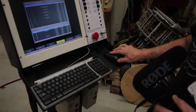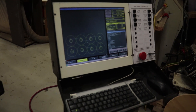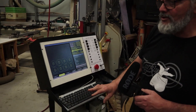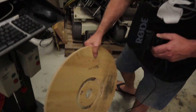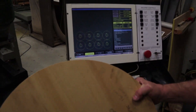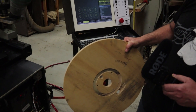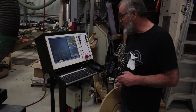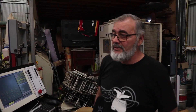I brought the USB up here — this keyboard actually has a USB hub built in and my mouse is plugged into that. On the screen is a nesting program I did with VCarve Pro for my client who purchased this machine. He makes cable drums, and instead of cutting one at a time on his old machine, he can now cut eight at a time — throw a whole sheet on, cut eight, take it off. That whole process takes just under 11 minutes, whereas individually they were taking about three minutes each including load and unload time.